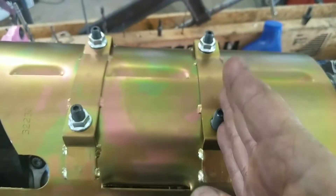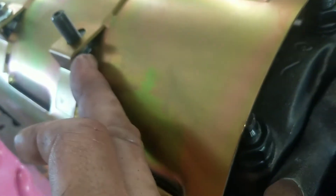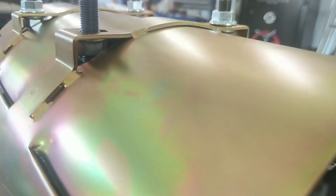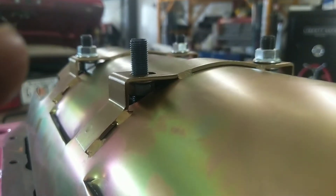You've got a flat here, flat there, flat there, and flat there. When you go to tighten it, get a small wrench up in there and make sure that doesn't turn. Or what you can do is put a dab of Loctite on that bottom nut, let it soak in, then go over it the next day and tighten that top nut down. Then once again turn the crank.